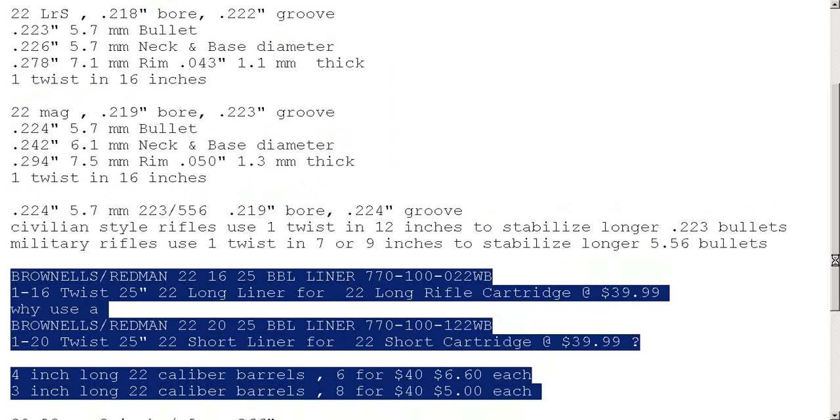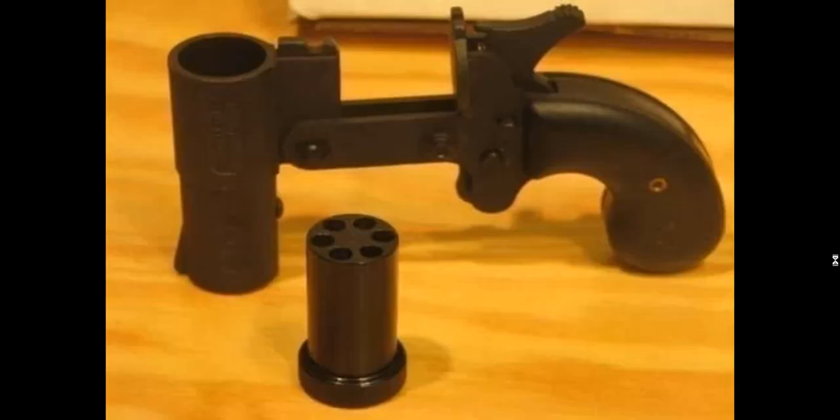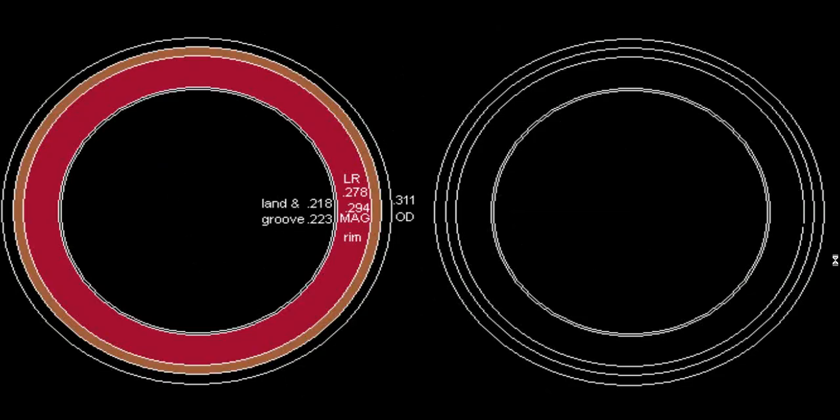But if you wanted to know all of this to build a legit revolver, you'd have some dimension data. So pretty much that's it. Thanks for watching. I'm not marketing this company — I'm just using them as an example because they published the data on how big or small these barrels are, and I needed that data for a starting point. It's plausible and doable. As for whether or not COBRE did it that way — the other method would be to have the cartridges tilt inward and fire in various directions, and that was not reported as happening. So I'm pretty sure that they made themselves an overbore 12-gauge barrel, chopped off the back so it wouldn't be a violation of the law, and then put the cylinder in it because they wanted to market it. I'm pretty sure they were also probably planning on making a fully metal version of the barrel for firing flares — it's actually the flare gun barrel, just with the butt chopped off. They made it out of plastic normally; that was the metal version, and they decided not to push the ATF over the edge. Thanks for watching. Have a good day, and I hope this was useful.